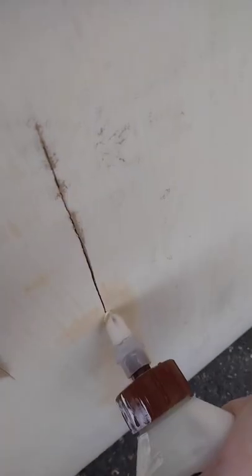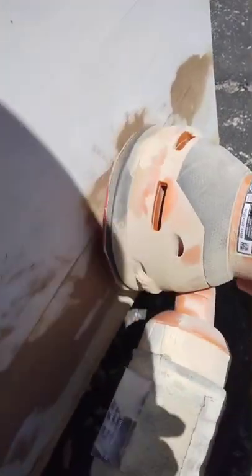The plastic wood didn't work on these giant cracks, so I came back and used carpenter's glue instead. A day later I returned and sanded down the excess glue. Next I used a screwdriver to reshape these drawer grooves.